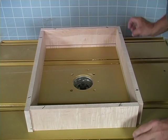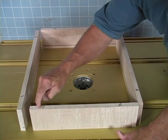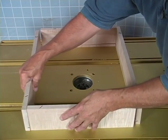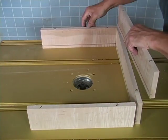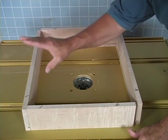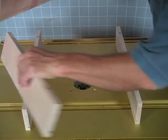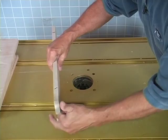The first thing we're going to do is cut the dovetail using a dovetail bit here and a pattern bit here, and those two joints have to go together. It's not going to work where number one and number three fit together — the numbers have to align. We're going to cut the dovetails into the sides first.